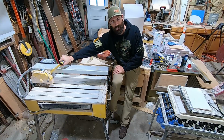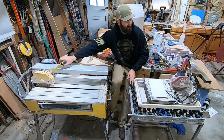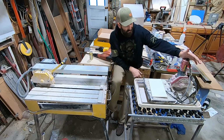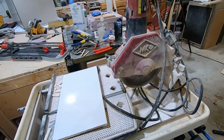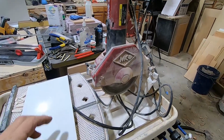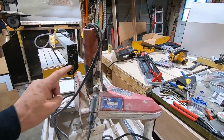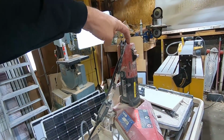My go-to tile saw is another Craigslist find, right here. This is an MK470. It's basically an angle grinder turned on its side, hooked up to a wet saw blade. Give you a close-up. They don't make this model anymore. I will put a link in the description to its replacement model. It's a little bit different design. You don't have this angle grinder deal here.